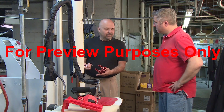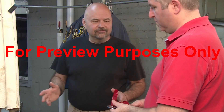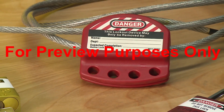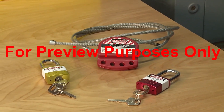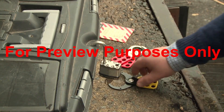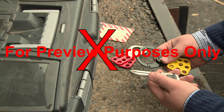If you are involved in activities requiring lockout/tagout procedures, your employer will provide the locks, tags, and other devices you will need. These must be identified as lockout/tagout devices only. They cannot be used for any other function and may not be shared with other workers. You should also never use non-designated devices for lockout/tagout. For instance, you shouldn't take a padlock from a locker or toolbox and use it to lock out an electrical panel.